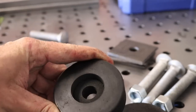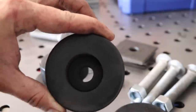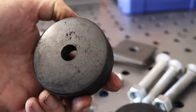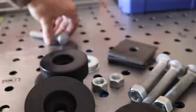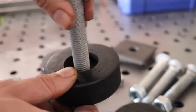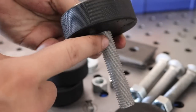After you drill them up to size, this is what they're going to look like. So 5/8 hole in the middle in my case, and then 1 3/8 I believe exterior. I purposely left this hole a little bit snug because once you tighten these down into it, this part will grab into it, so I'll be able to tighten everything and it should stay pretty secure. Yep, so that will pull down once I tighten this.